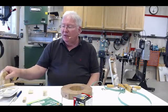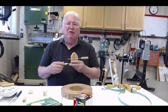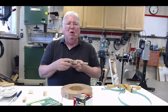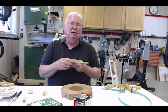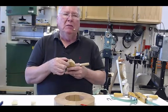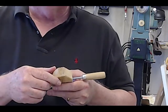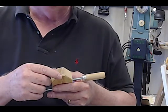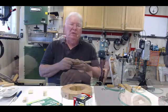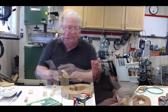We're going to start by taking our screw clamp — a four inch clamp is a very convenient size. At the end we'll mark where we're going to put our Romex staples in on each side of the screw clamp through the center, to give it as much meat to bite into as we can so we don't worry about it splitting out. After marking, take a 1/16 inch diameter drill bit and drill a pilot hole. Once the holes are in, take your Romex staple and drive it in.